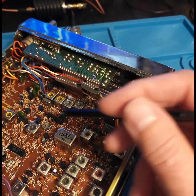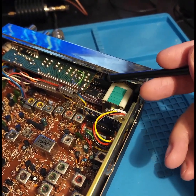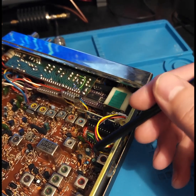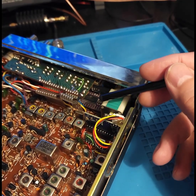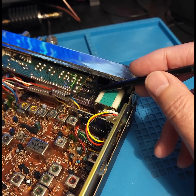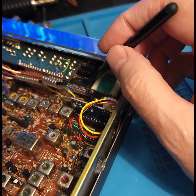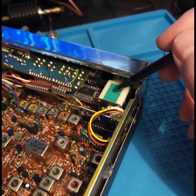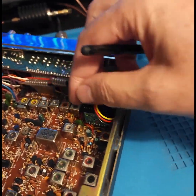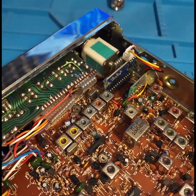It's all pretty much standard. All the circuitry is pretty much standard, except really the channel selection and the dial, and the channel display are pretty much the only things that I've changed, plus the VCO a little bit. This is an HT16K33, I can't remember what it is. That's the chip anyway that drives the LED from an I2C bus. The original channel dial is in there, an Arduino Nano in there, and then there's a serial PLL chip here. All right, I'll show you what I did on the circuit.